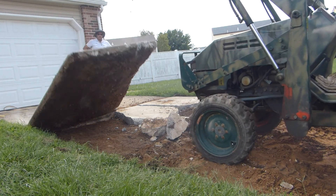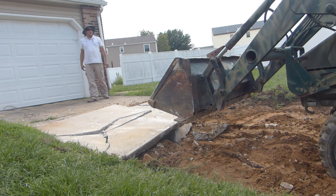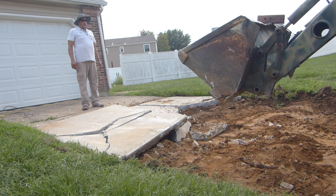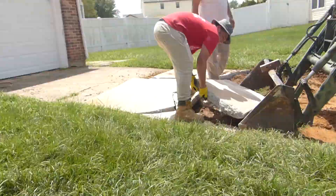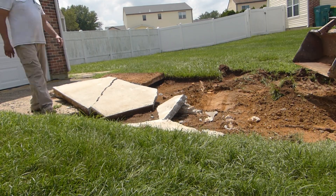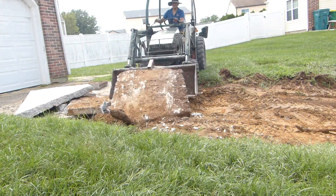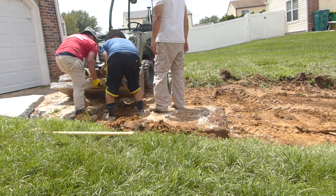This is another instance where you see how fragile concrete is. It's very fragile — not as tough as you would think. It just doesn't have flexibility. Once you add the materials to it — the steels and the post-tensioning — then you can have concrete that will act like it's flexing, like on bridges. But it's the rebar that's keeping it together and controlling the cracks.